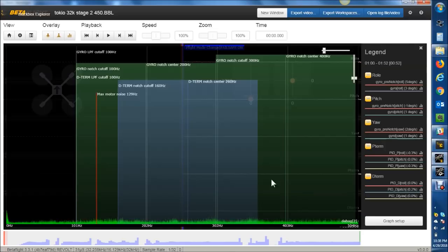Eight kilohertz sampling rate would give you a four kilohertz window to see into. Four kilohertz I think would be acceptable as well, but I really wouldn't go below that.